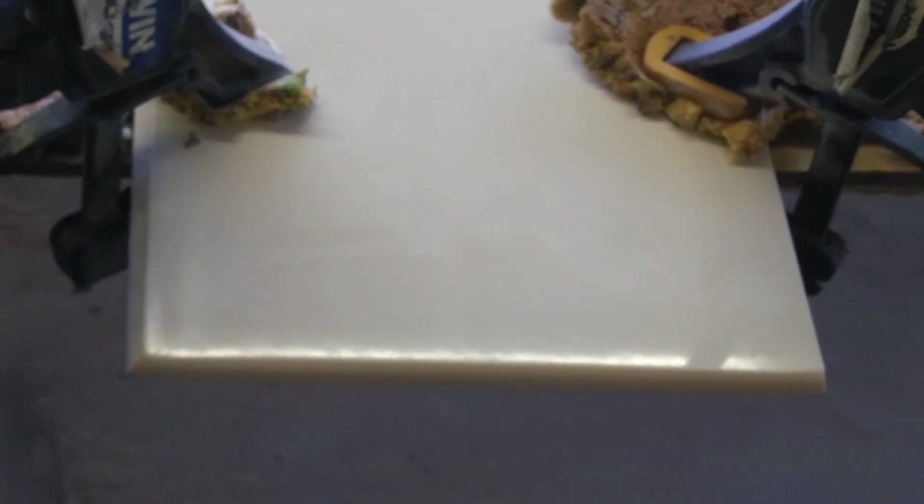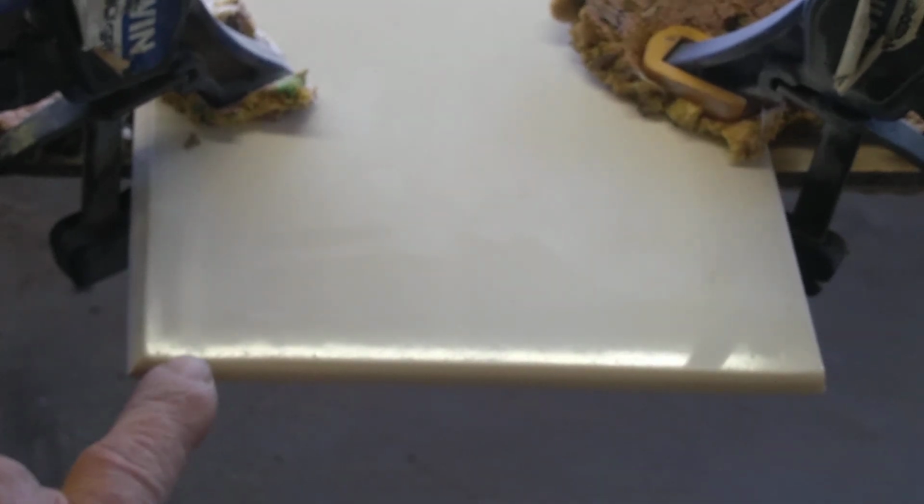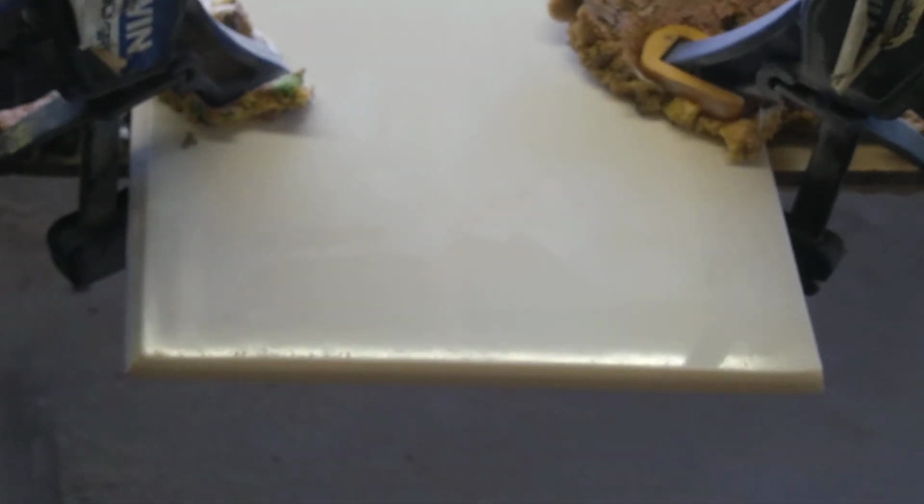Like I always say, take the time to do it right, and you'll be glad you did. Now I'm slightly catching this edge, this ceramic finished edge. Okay, just kind of taper it and round it down with the bullnose as I'm doing this. Yeah, I'm going to hit that with the palm sander. I'm seeing something I'm not liking. It's not coming out.